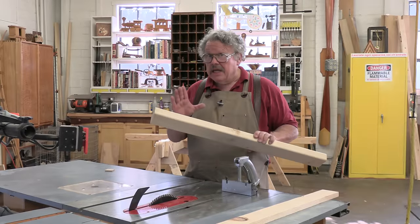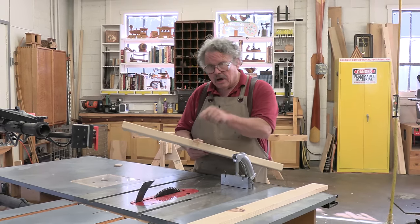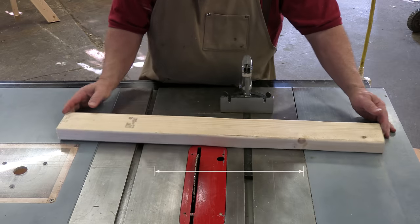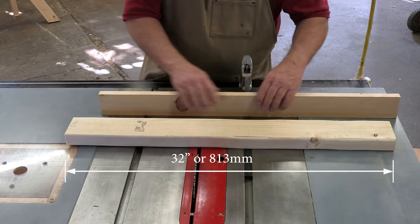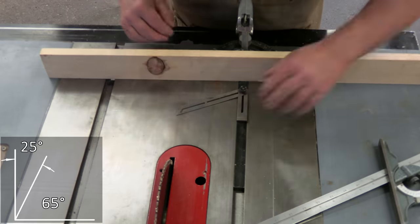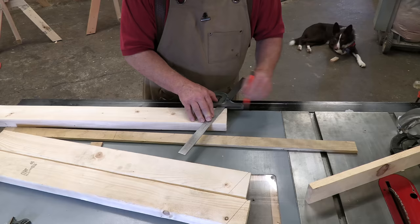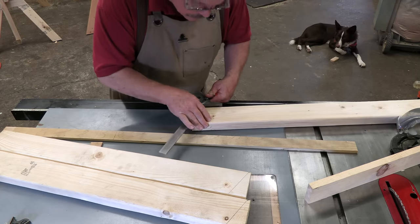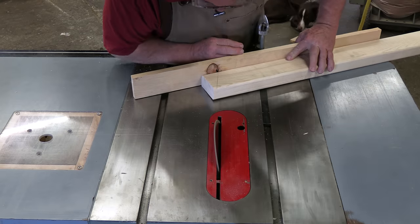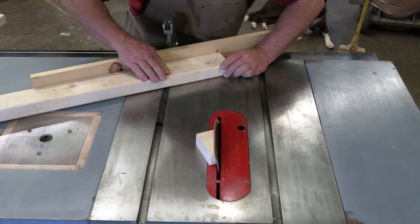Let's make a leg. The trouble is, making this with a circular saw obscures the work because it happens under the saw. So I'm going to make one leg on a table saw so you can see what's going on and then we'll make the rest on the circular saw. Cut your leg stock about 32 inches or 813 millimeters long. Attach a long board to your miter gauge to extend the face. Angle the miter gauge at 65 degrees — 25 degrees off square — and tilt the saw blade 15 degrees. Mark the 25 degree miters on your leg stock. The mark should be exactly 29 and 13/16 inches or 757 millimeters apart. Cut the compound miter in one end of the board and move the miter gauge to the other slot in your saw and cut the other end. The ends now have a single bevel at 15 degrees.